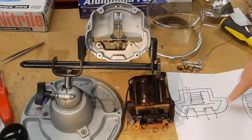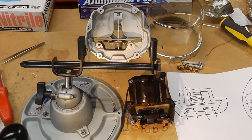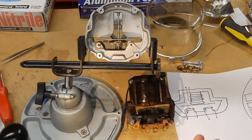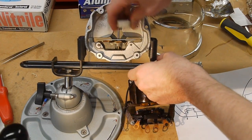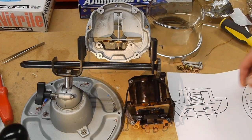We have these waves sort of undulating through here that cause the disk to move. It's similar to taking a very strong magnet and bringing it near the disk and moving it around - you can see that it pulls the disk around because the eddy currents are so strong. This moving magnetic field causes the disk to turn because it's inducing current, and then the magnet moves and that current is pulled toward the motion. So it's in sync with the magnet. This arrangement of coils with the copper ring produces essentially the same thing as moving a permanent magnet along like this.